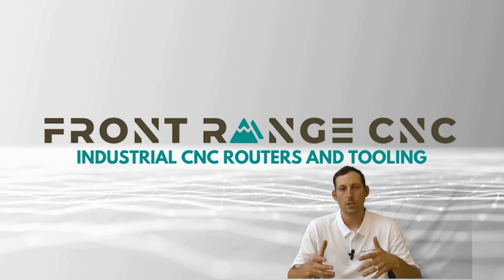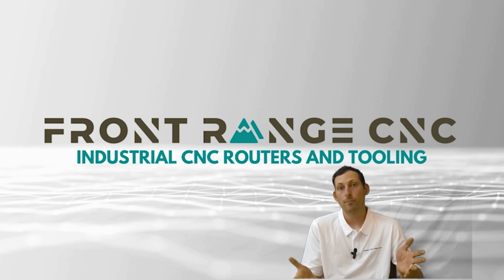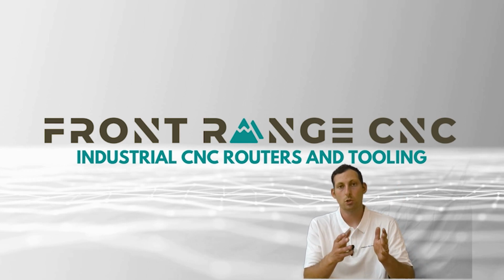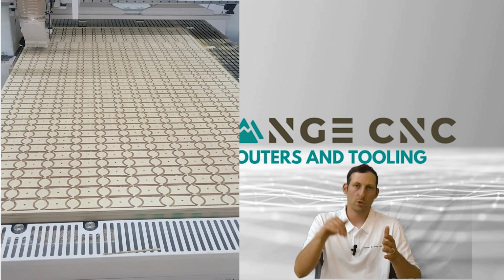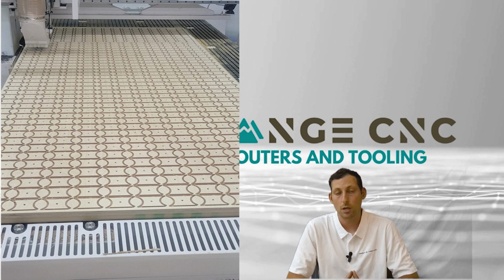And I say this because you can start to think that if you've got a part on the router table that is being held with, let's say, tape, you don't have a really strong seal to begin with. And so a down flute might actually be a good thing, because rather than the router bit pushing that piece up or even a straight bit moving it laterally, the down style bit is going to apply forces downward. And that might actually be advantageous to you, depending on what you're cutting in that moment.